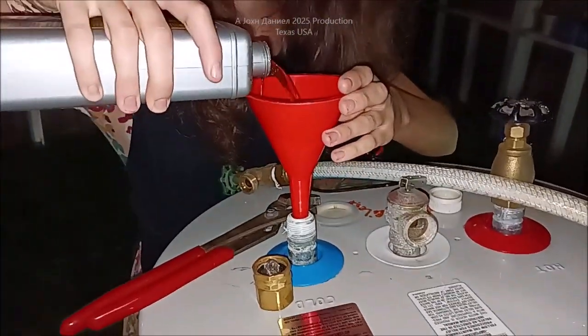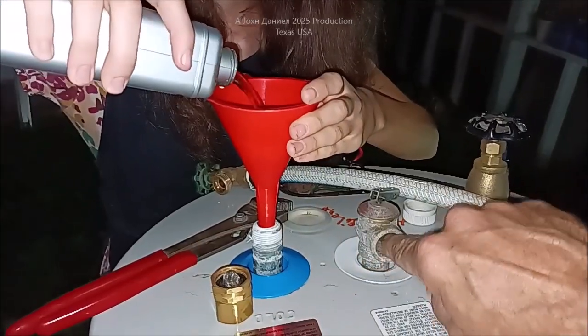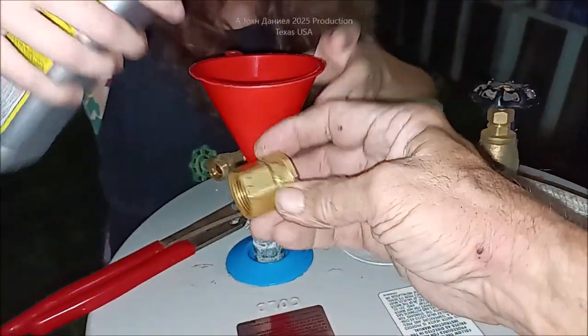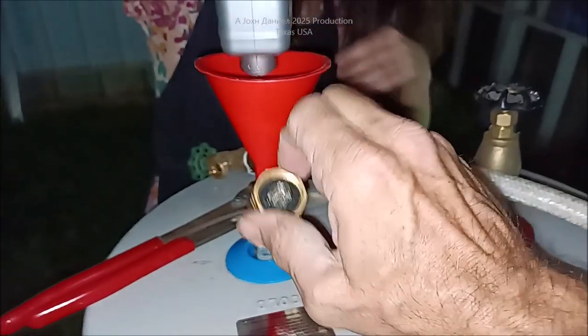I'm going to pour it in carefully into the cold side. We've removed all these fittings and I have added a three-quarter purge valve over here. This is the TP valve — your pressure release valve — and this is the cold side. Below the video I'll make sure I put a link to these parts so you guys can do what I'm doing here. This makes it a lot easier.